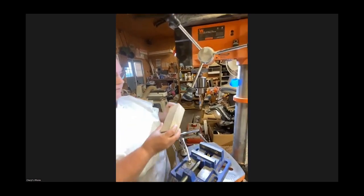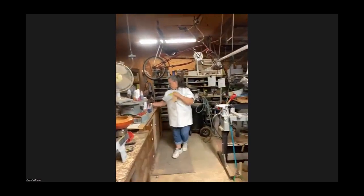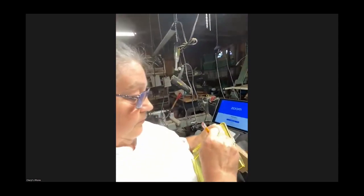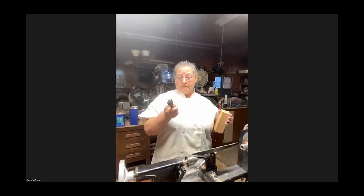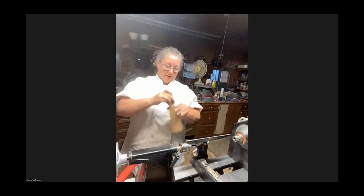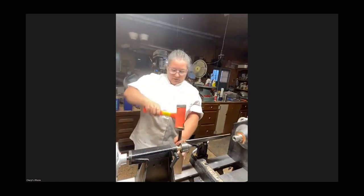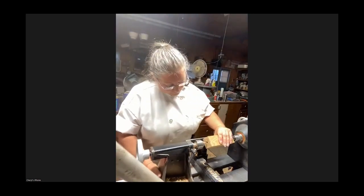So now we're ready to go over to the lathe. Hey Brenda, do you have a paddle out there to show what you're going to make? I didn't get one out, sorry. No worries. We're going to try and put this in the chuck now. I'm going to use a spur drive on one end, mark the other end, get the hole in one end, spur drive on the other, put it in the center, pound it down in there, and put it on the lathe. You're holding that with a 60 degree cone live center.